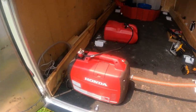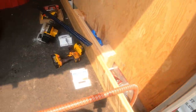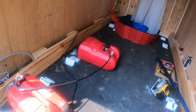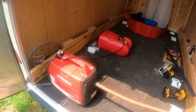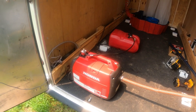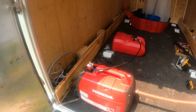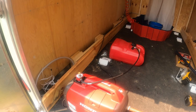Back here I have the Honda 2200 with the generator exhaust extension going straight down and out through the floor. The floor is aluminum, so I'm not too worried about that — I might put some heat wrap around there. I've got the Berg system with a 6-gallon tank powering the Honda, so it'll run for about 48 hours before needing to be filled. My plan is to fill it up once daily and not worry about it. It'll need an oil change every 4 days if running continuous — I might do it every 3 because of the abnormally high temperatures back here. This back part will get a little over 100 degrees with the air conditioner exhausting back here.